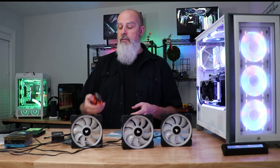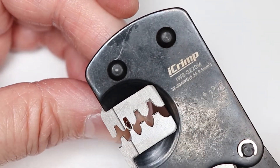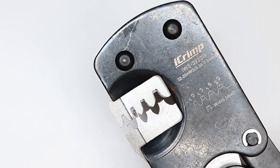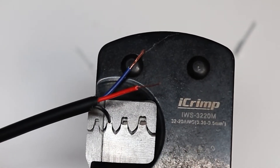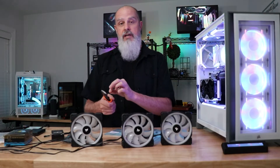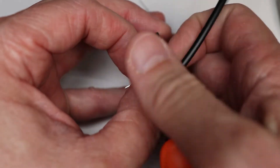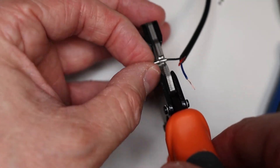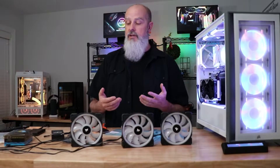Once you've determined which cable is going to go where, take your crimp tool. What I like to do is put the pin in there first and squeeze it so it's in there tight, then set the cable down in from the front of the crimper. Once it's pre-positioned up into the barrel, just go ahead and crimp it together, let go, and use your fingers to pull it out of the mold. That crimps it down nice and tight and you're ready to go.